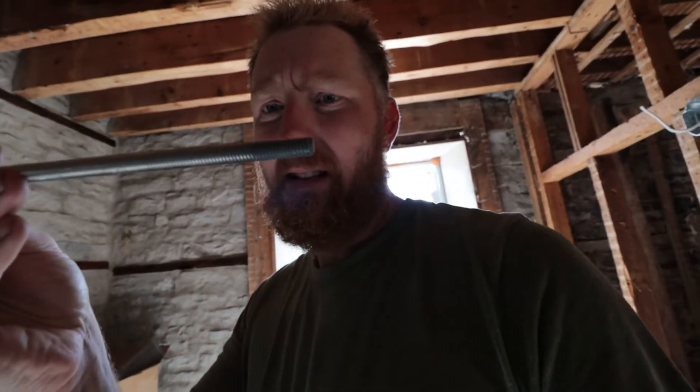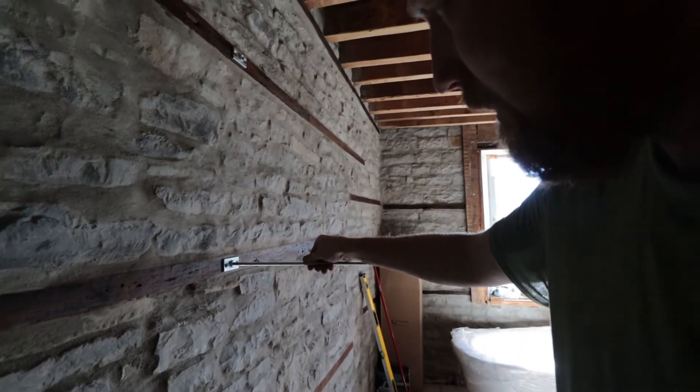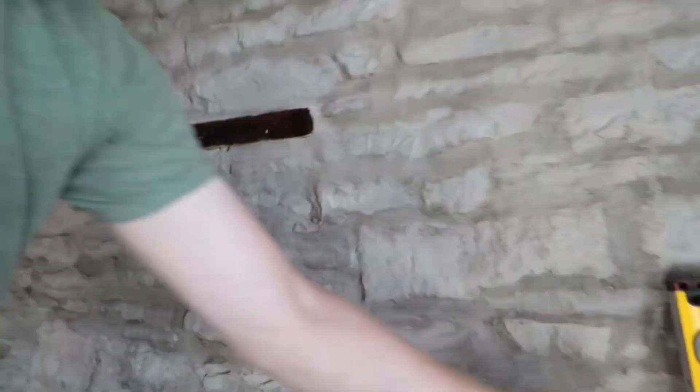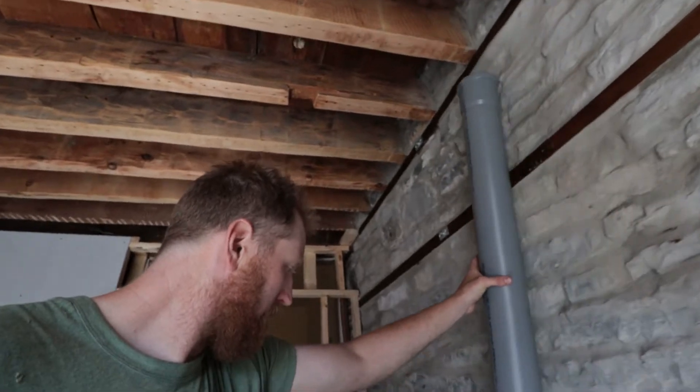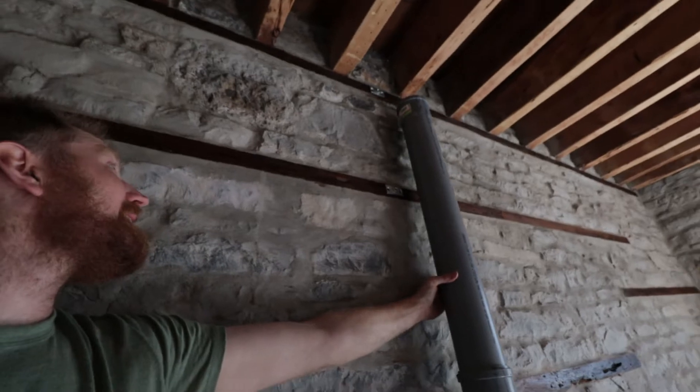We got our three clamps. We're going to go three here, and then upstairs there's a little spot where the roof line is — there used to be a bathroom there. We'll throw one more support up there, and then it'll penetrate through the roof and there should be plenty of support. Next thing I need to do is cut the ready rod way shorter, then thread it in. I just got the ready rod cut using a sawzall or just a hacksaw.